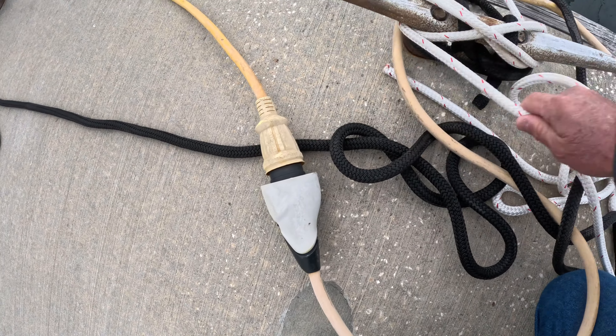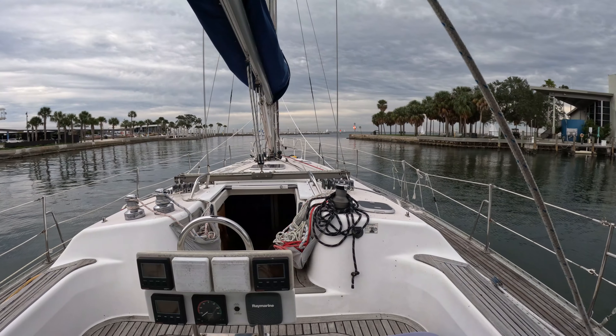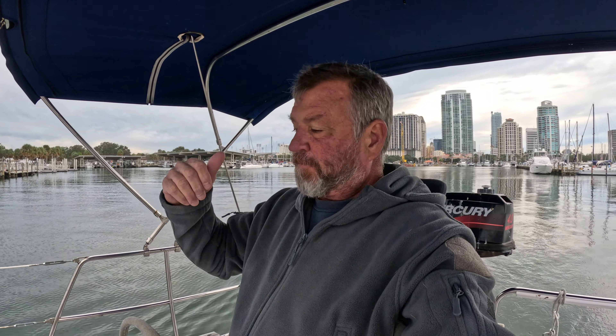Okay, we cleared the dock and went through our checks. We undid the lines based on the wind — if the wind is coming from the back of the boat to the forward, you're allowed to take the bow lines off and the shore power first. Today the wind was coming from our stern, so we left the stern lines on. You saw the spring lines being released. Don't forget to mark those because it's much easier when you get back to the dock to know exactly where they need to be. We backed out slowly with the rudder straight.